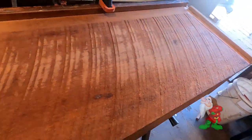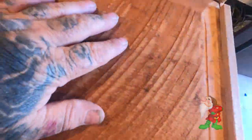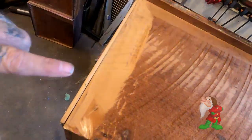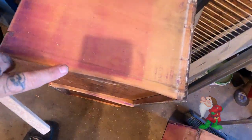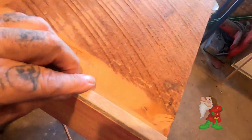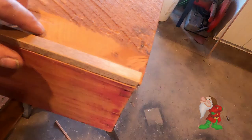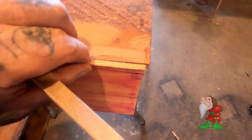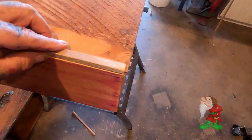And I've got this drawer. You see the old timber, that's old circular saw timber. That's not bandsaw computerized stuff. So what I've done is I've cut these off, and I've come back and cut some of this. What I'm going to do is put a generous amount of glue under it, so it'll glue in that joint as well. Plus these, see they're cracked, the same on the other end.